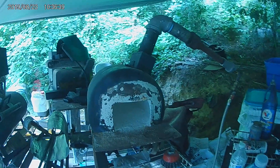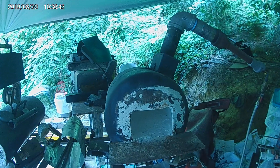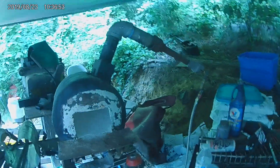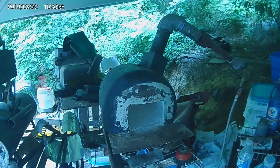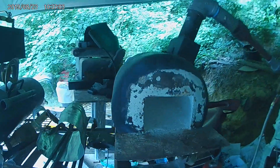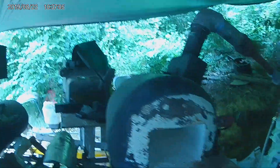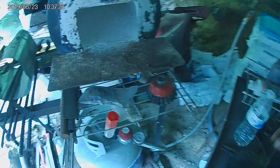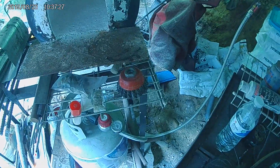The orifice with a ribbon is generally maybe a little smaller than a sixteenth of an inch hole. What I'm using is a .030 mig tip size — that's much smaller than your average ribbon burner jet nozzle. Actually, I'm using a proper propane nozzle. I broke it off of a grill, so it just has cast aluminum around it, but that's the orifice. Very, very small. I think it's the same exact size as an .030 mig tip.